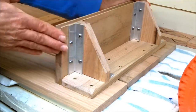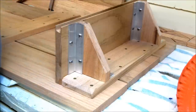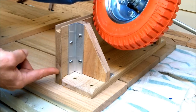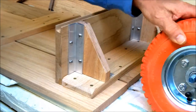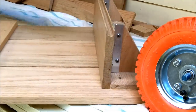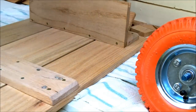This piece is 16.5 inches long, and the height is determined by the wheel size. I chose an 8-inch wheel, giving it about a 1-inch clearance, so this particular piece is 5.5 inches tall. It is glued and screwed into the bottom brace with exterior grade screws.